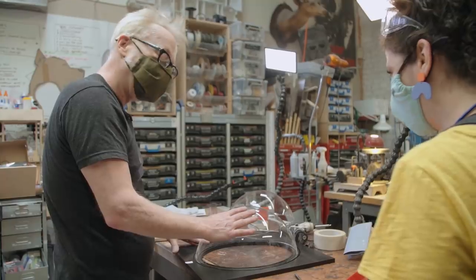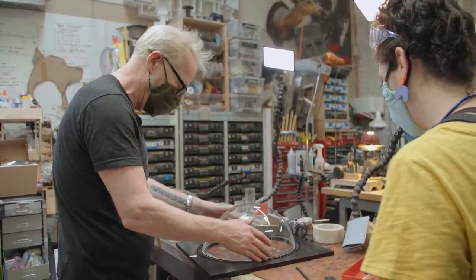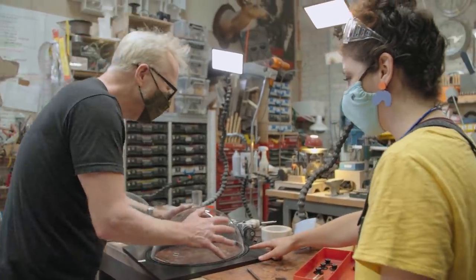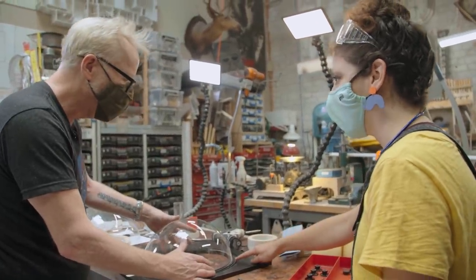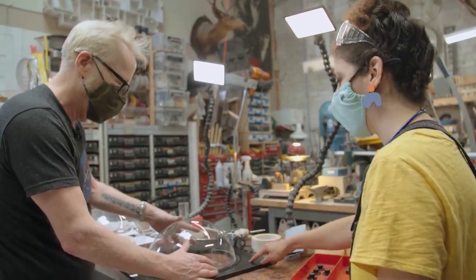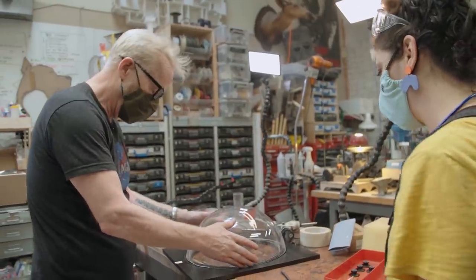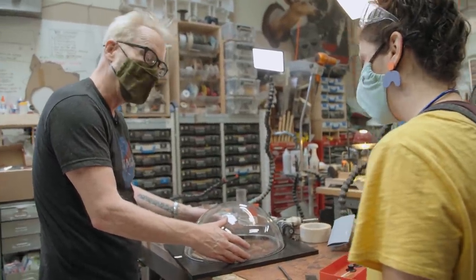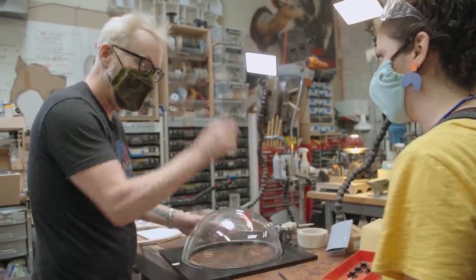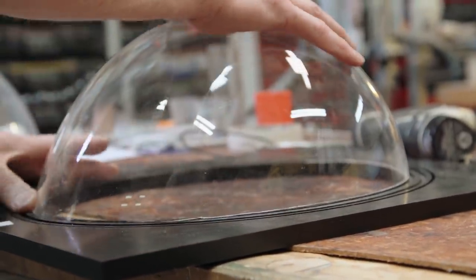That's wonderful. All right. Time to start cutting out some visors, I think. Now, Norm brought up a great point, which is that because of the irregularity of these, this pattern may not perfectly work for the other set. So before I cut it out of Delrin, I'm going to cut the other visors, test it, and if I have to alter the geometry... Yeah, I think that makes total sense. Okay. So go ahead and make your marks on those visors with tape on them. Add 150 thou, cut at the 150 thou mark, and then we'll start to adjust them to this.